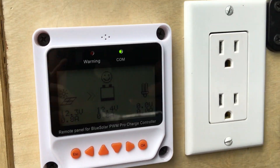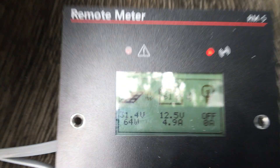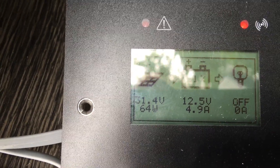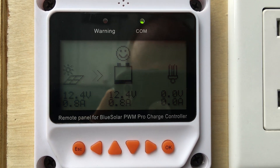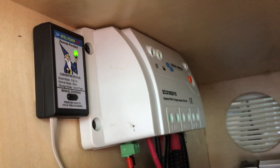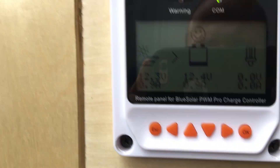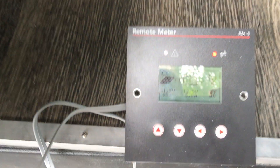The main thing I want to show you is that their system — 180 watts — is putting out 0.8 amps. Ours, on an MPPT controller with an industrial-grade panel, is putting out four to five amps. So five amps here, 0.8 amps there — that's like five or six times the amount of power. They've got it through a rebadged EP Solar PWM controller. So they've got 180 watts through a PWM on a kind of cloudy day making 0.9 amps, and our 300-watt on a nice MPPT is making five amps.